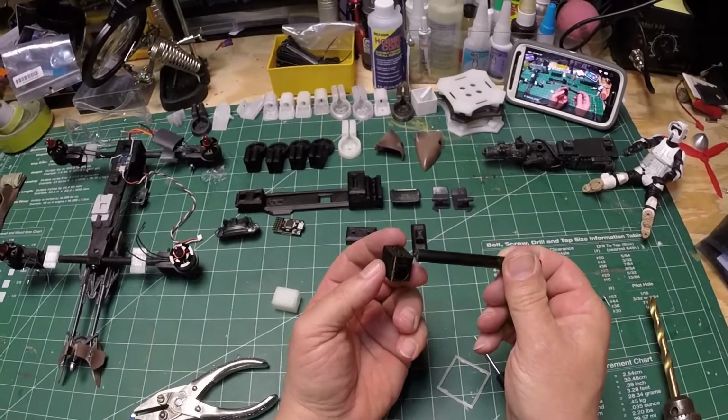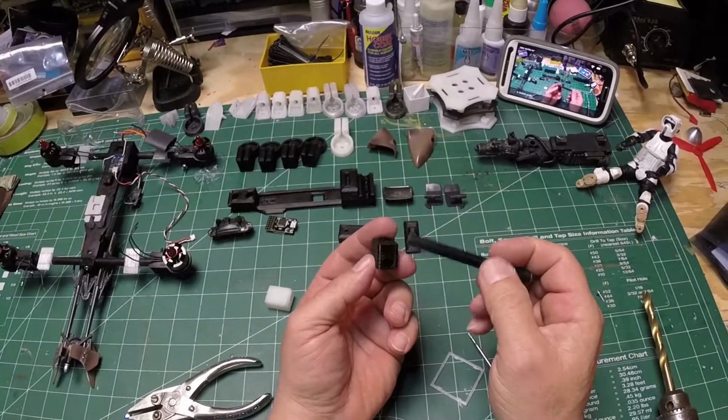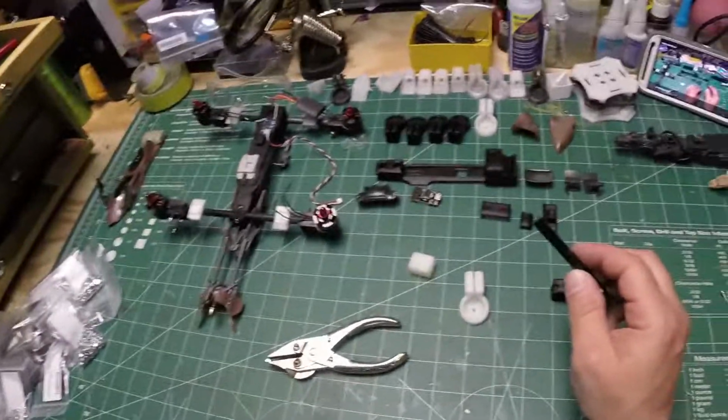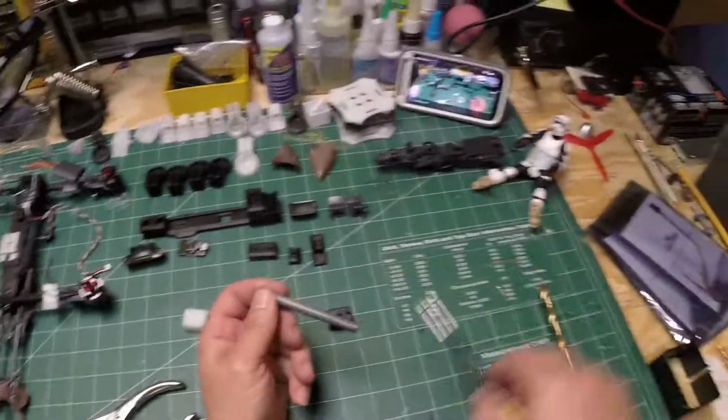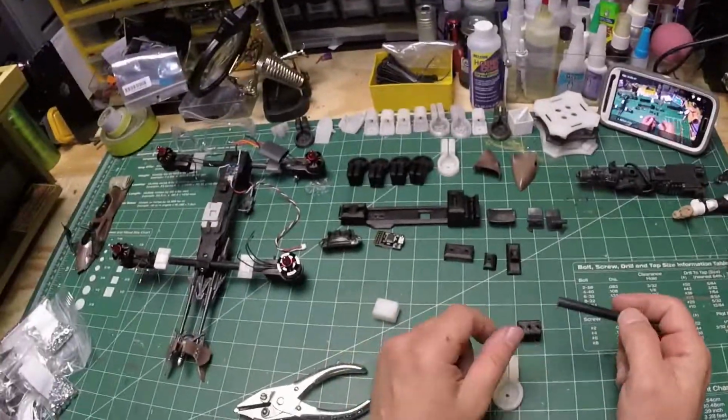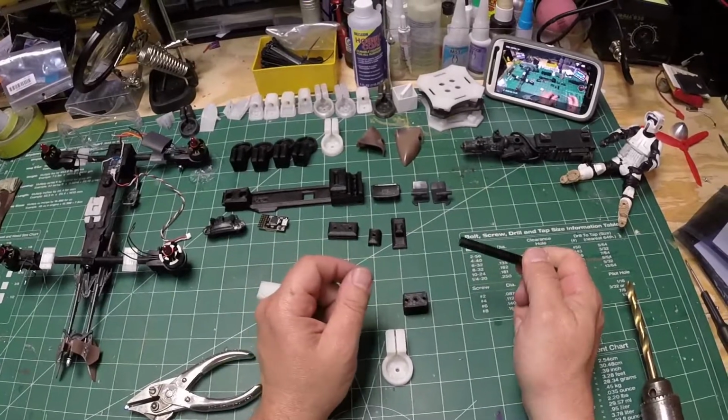When you drill carbon, you should wear a mask. Do it with an exhaust fan. Be very careful. Read up on carbon on the internet and how bad it is for you. And wear your goggles. You don't want carbon in your eye or whatever.